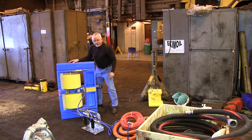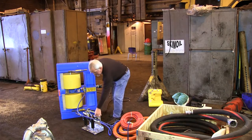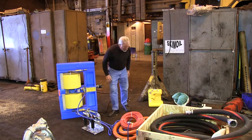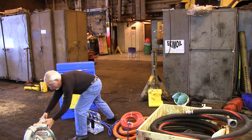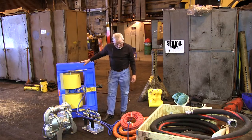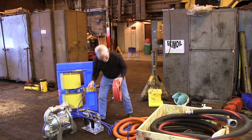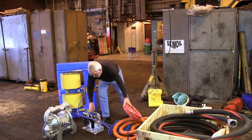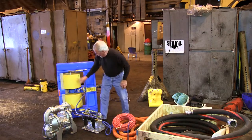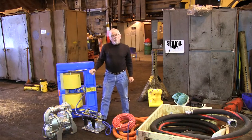Over here, oil flows into the sump. Part two of the operation is hooking the pump up. Here's our pump. This is a two-inch air-operated diaphragm pump. The red air line is for the pump — the air connection is here, and the other end connects to the fitting conveniently marked 'to pump.' The blue air line feeds the skimmer motor. The pump does not require an oiler.